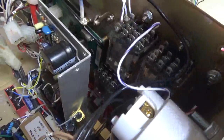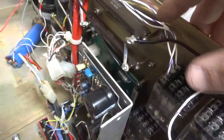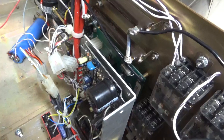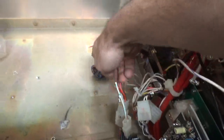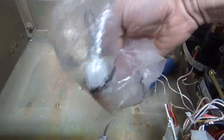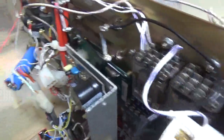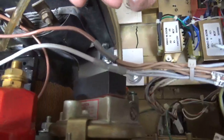All of this needs to be wired still. All Teflon wiring, except for the stock wiring — but the center conductor is actually silver-plated stranded. Good stuff. The cap for the delay-off for the blower is already here. And you have a nice locking bat switch for the on/off, which will power one of these relays. These all have a 240 coil — nothing in here runs on 120, it's all 240. Got the pressure interlock installed.